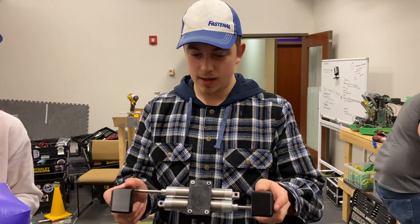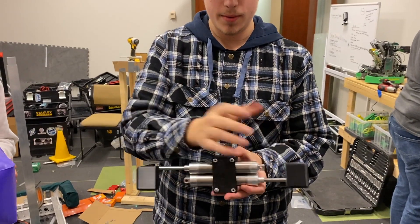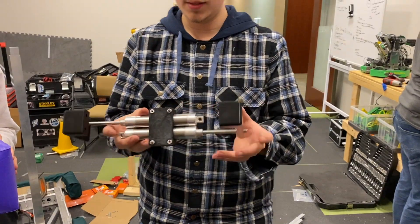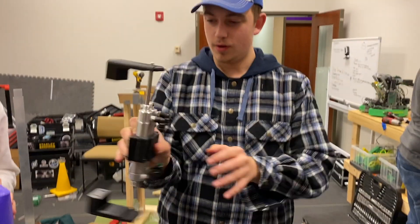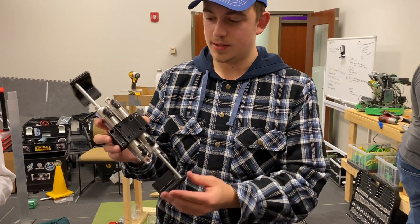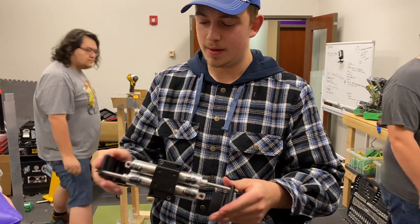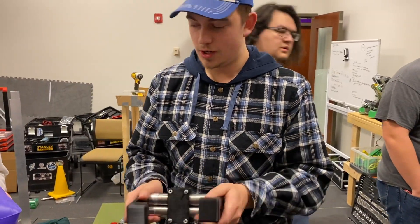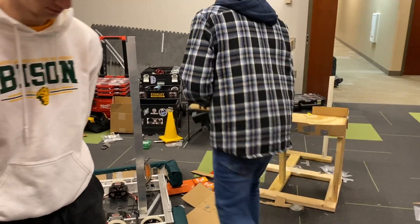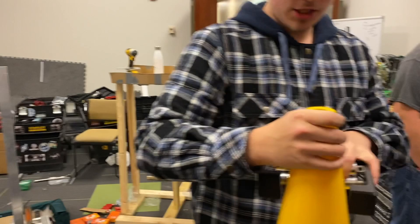The grabber is designed so that there's going to be a quarter-inch thick by 10-inch long piece of aluminum with little bearing holes and grippers on the end — those will actually hold it. This is kind of the base design. Our two pistons are here, they'll be powered by pneumatics, and they'll basically become one of the same cylinders — they'll be connected together so they both go out at the same time and both go in at the same time. So we can use the same actuator for both.